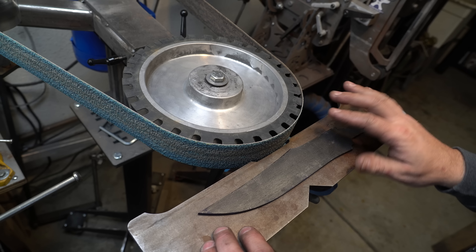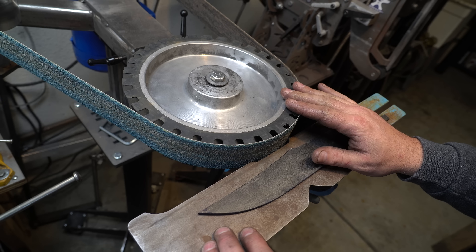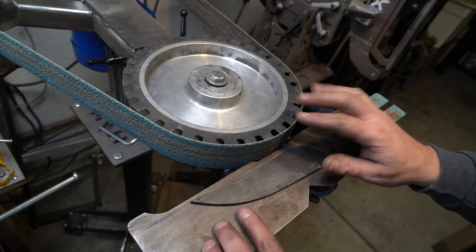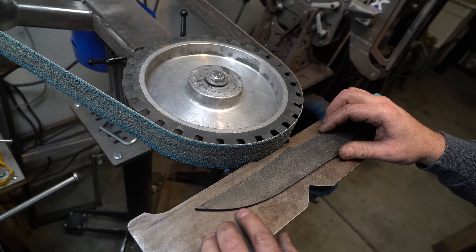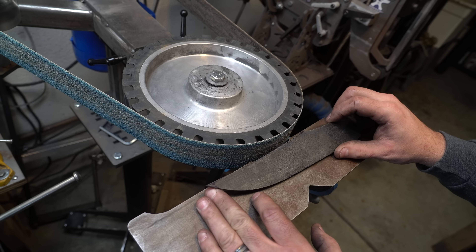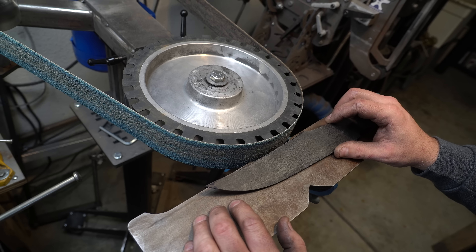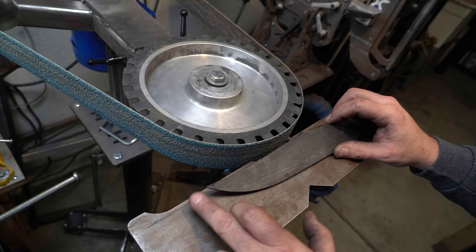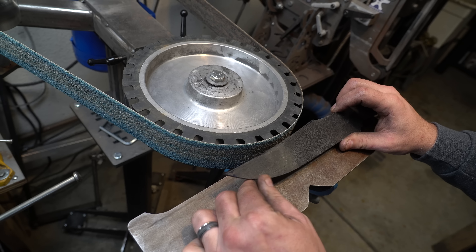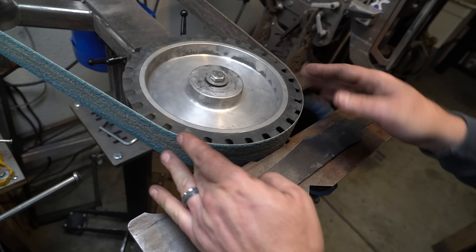For this process we're going to be using a 10-inch wheel. You could get away with a six-inch wheel; I wouldn't go as small as a four-inch, but I tend to use a bigger wheel for this — 10 inches is about perfect. The reason I'm using the curved wheel is that this edge is curved. If you try to do this with a flat platen you're just going to get flat sections and it's not going to work. If this was a straight harpoon edge I would use the flat platen and just put the whole thing up at once to get one nice bevel on either side.